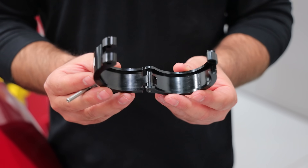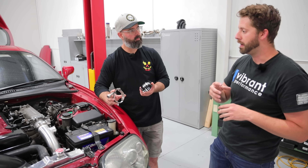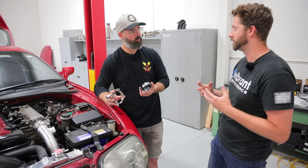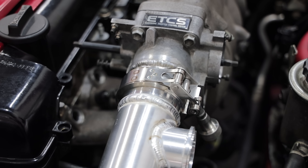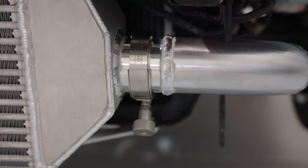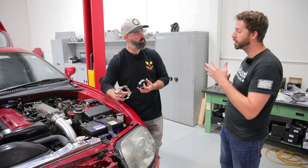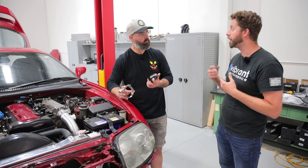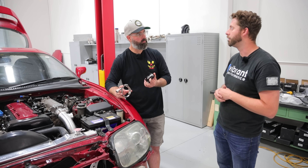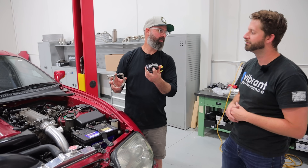And ultimately it's not a fault of the clamp — it's unfortunately during fabrication that not all the clearances were taken into consideration. So we have an HD alignment tool at both ends here, which means those ferrules are captured right in the middle of their motion between the two. When we go to put the HD clamp on, we're not going to be squirming with that union sleeve and fighting to get it on — it should just go on very easily. In layman's terms, these square your ferrules up nice and good, even gap, makes it easy to put this thing on there. Job done.